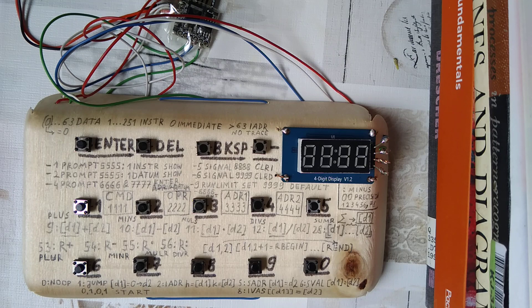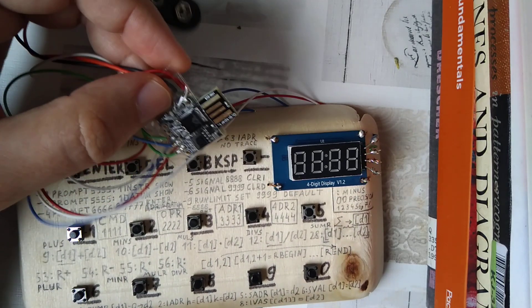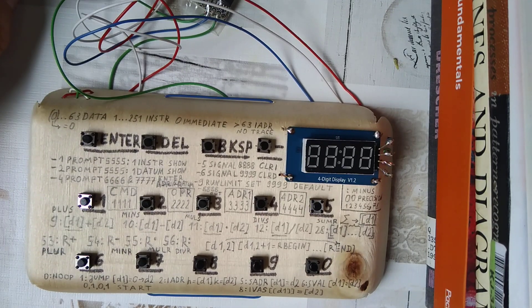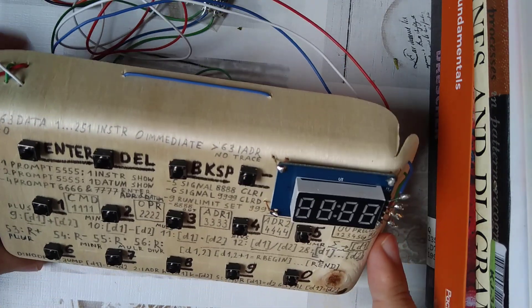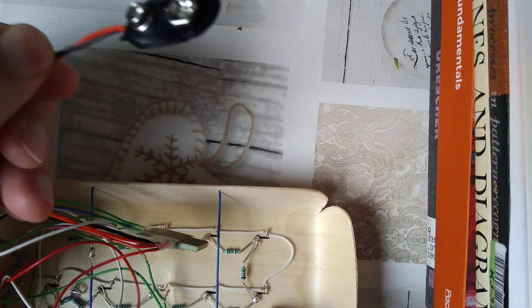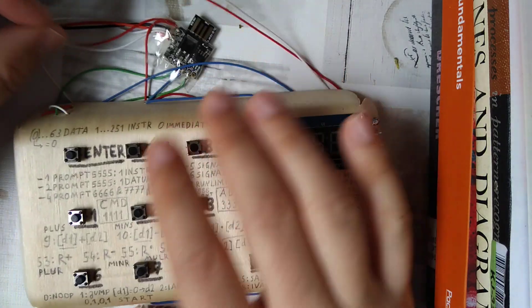Today I checked on Alibaba and I am coming to about $1.80. Specifically, if you count together the brains of the machine — an ATtiny85-based board — and its display device, the TM1637-based board, I am coming to $1.75. The rest of the machine consists of a couple of push buttons, an empty tic-tac box which you can substitute with anything you like, a couple of resistors forming the resistor ladder I'm using for input, and a battery clip. So the entire usable device, not just the board itself, is under two dollars.